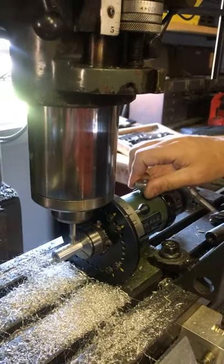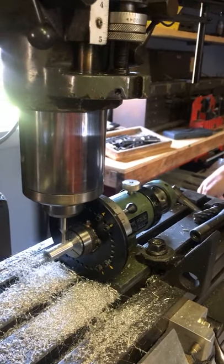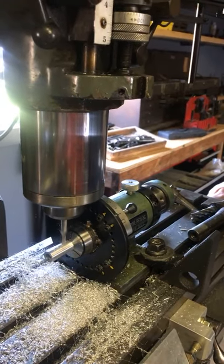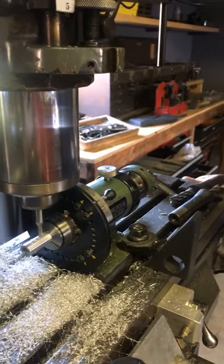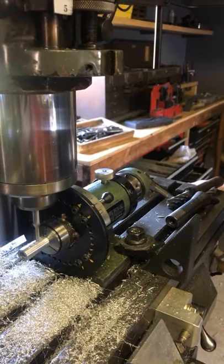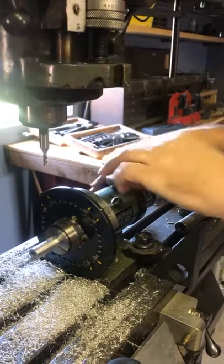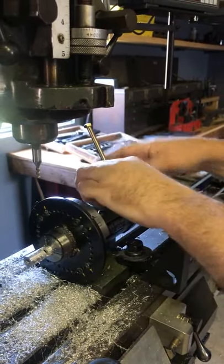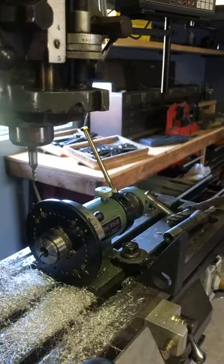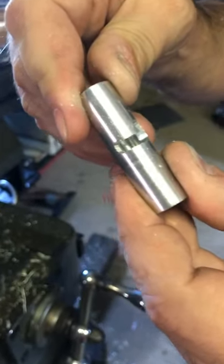The only thing I have left to do is the little detent for when the bolt action is in the writing position. I need to go about 50 thousandths, so with my right hand I'm backing that table up. There is the bolt-action slot — the bolt-action slot.